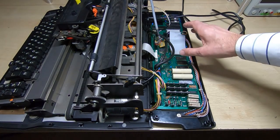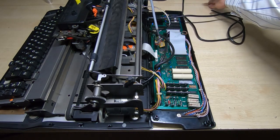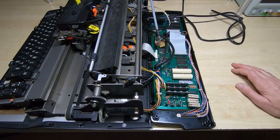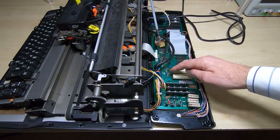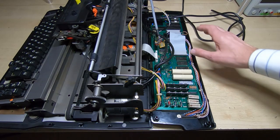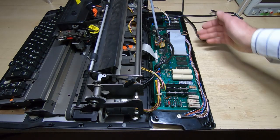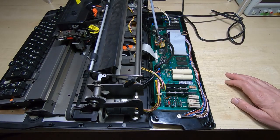Okay, it's still doing the same thing. Now looking at some of these devices, they've got incredibly dirty, corroded pins. I'm just going to pop one of these out and have a closer look - it might just be as simple as the leads on the ICs needing cleaning. There is some obvious damage here that we'll have to look at more closely and test the various supplies, but the first thing I'm going to do is pull out one of the ICs and see if there's any serious corrosion deep in the socket.